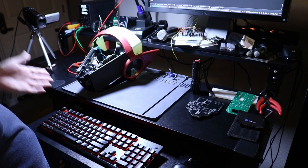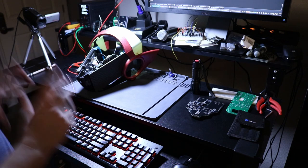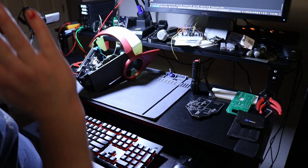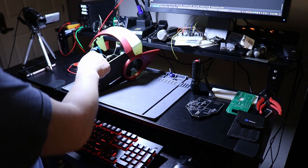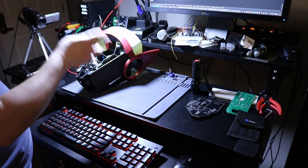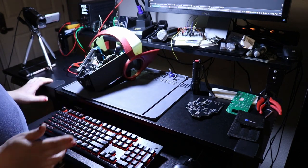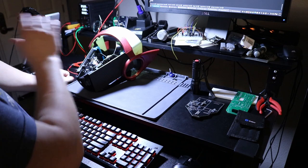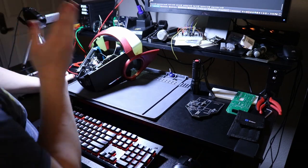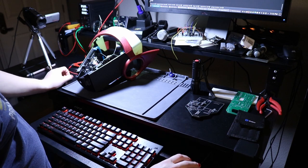And this is using the same kind of SPI methodology that the normal program is using. There's no DMA involved here, but we want to make it do DMA. I have gotten this working with I2C in DMA earlier in the past, but I2C got too unstable, so I had to switch this to SPI. So it should be relatively straightforward to do similar modifications to make this work over SPI. So let's just dive right into it.